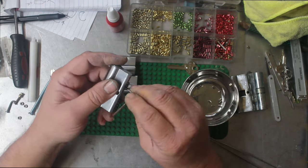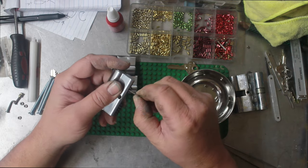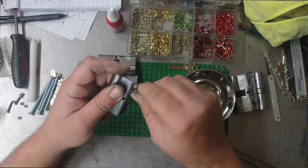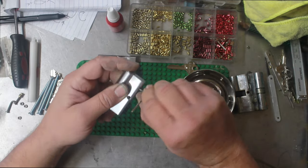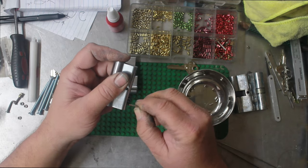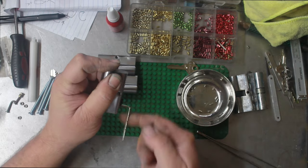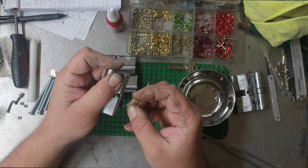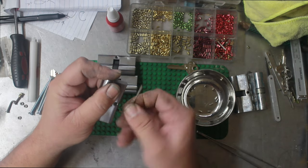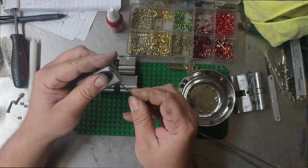So now just tightening them up. One. I'm just going to nip them up, then I'm going to hit them all again. Notice how I'm doing this. I'm doing this on a downwards angle, so there's no way any of that Loctite's going uphill. It'll go downhill, if anything. And I did it with the screws out, so there's no way it's going to come past the screw.